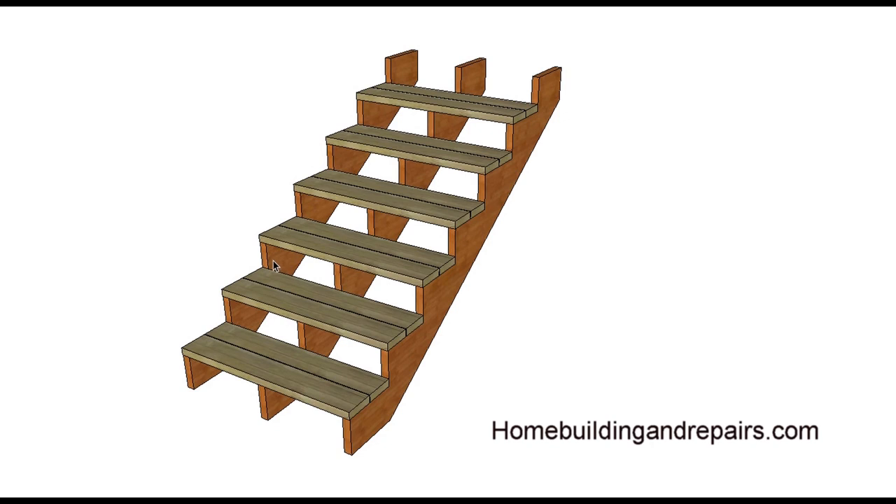It's a weaker material. If you have a stairway with three stringers and you're building something new, it wouldn't be a bad idea to space your stringers about 12 inches on center for Trex or an artificial product decking material. The bulk of the weight is always going to be on the front of the tread. Trying to space them less than 16 inches on center - I don't advise going over 16 inches on center unless you're going to use some type of riser supports. For new construction, use four or five stringers whatever you need.